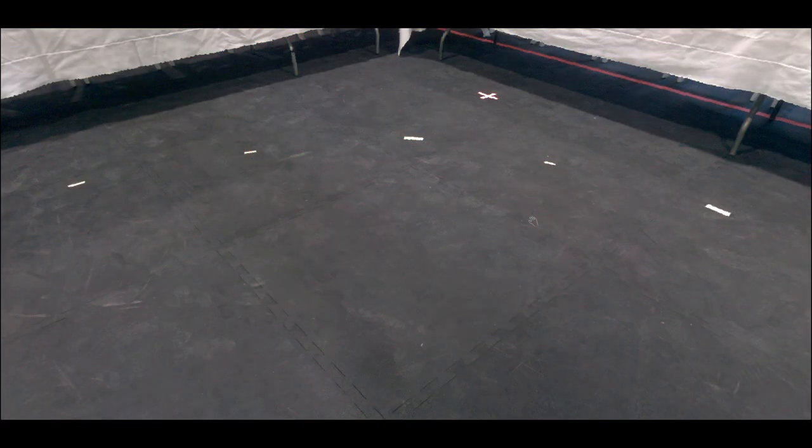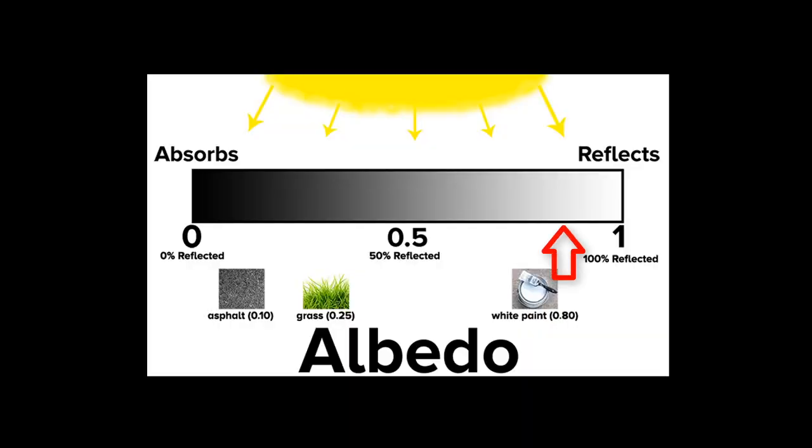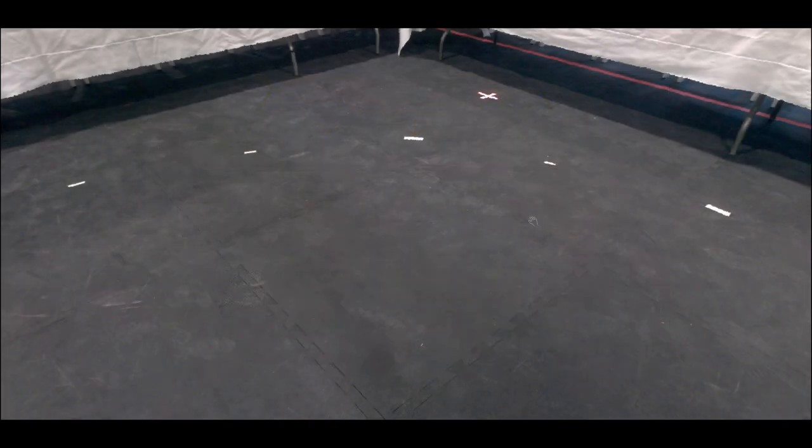One tip may be to apply small pieces of tape in strategic locations so that you can properly capture the surface. Always remember that you will still get more information off the surface, even with the tape applied, than had you measured it with conventional tools. As you can see from the scan, the tape markings show up nicely because they are a higher reflectability or albedo, which makes it easier for the scanner to, quote, see.